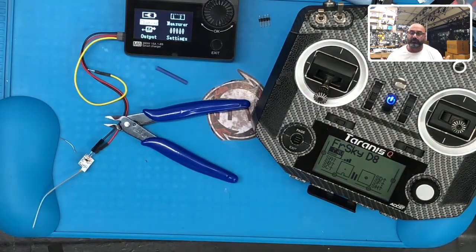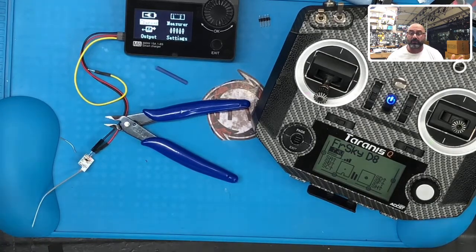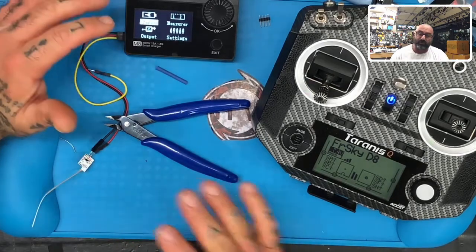Be very careful to make sure you have the right XJT firmware. In this case I'm running XJT 1.1.3. If you were running version 2.1.0 you would never be able to access it, because you have to have your receivers supporting that version — so make sure you're on the correct firmware.